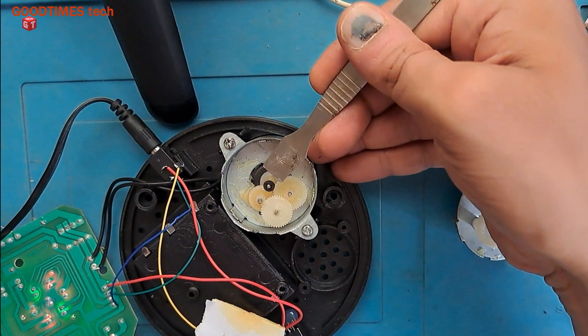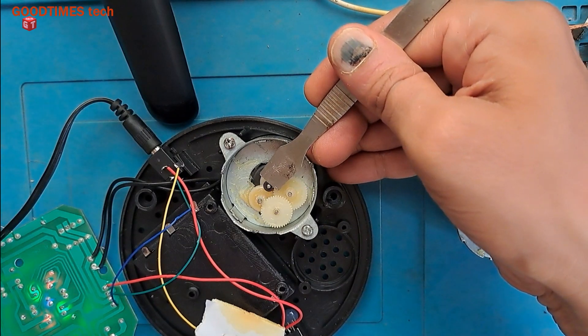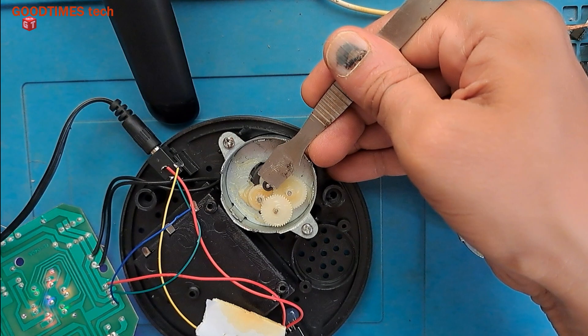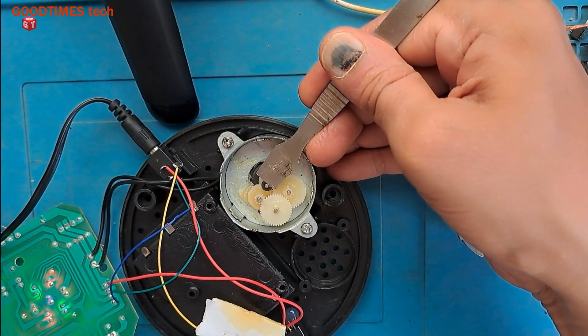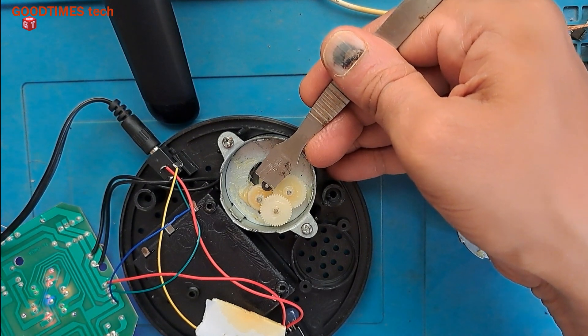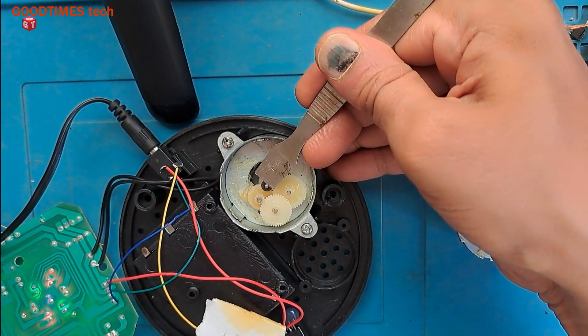Move the shaft a little bit towards the gear. See, the shaft should be fixed in this way — not too much, only until the noise stops. Now there's pin-drop silence.